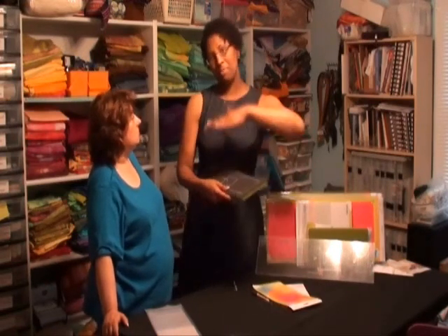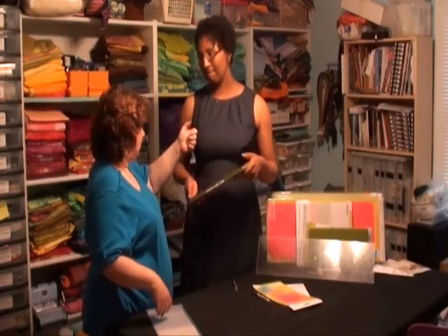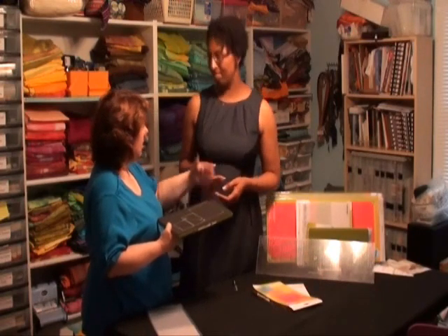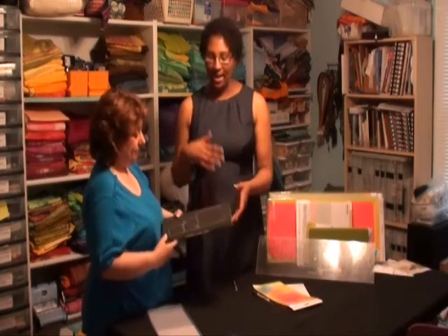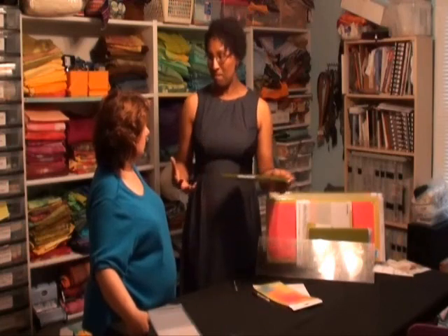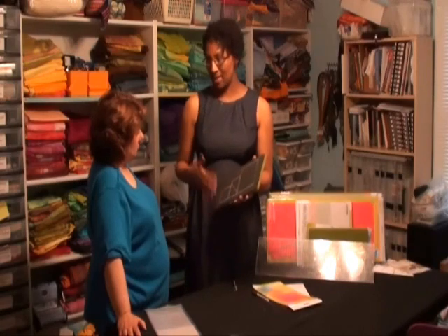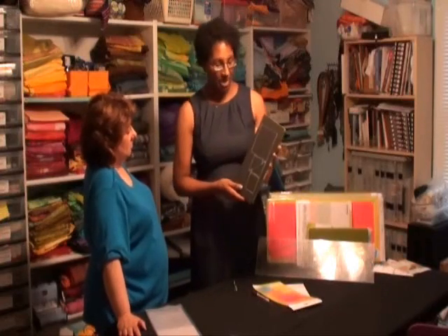Also, if you think about how scissors work — you squeeze and it goes along — so when you roll this under the roller, it presses here, and then here, and then here, moving it along. Whereas if it was straight, it would just go clunk, and that's where you can get miscuts. There are some dies where the shapes aren't angled, so you have to angle it yourself. Strip dies are not angled in the boards, and that's okay because the lines are vertical — so the strip dies don't have to be that way.